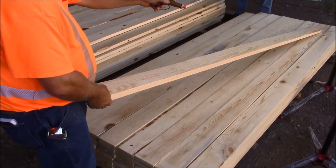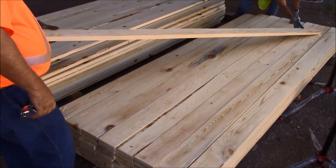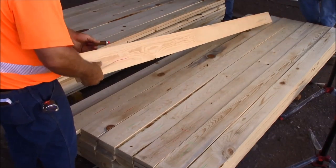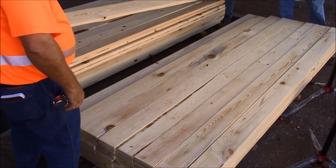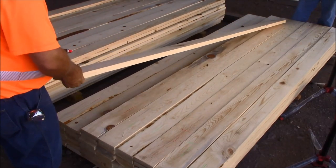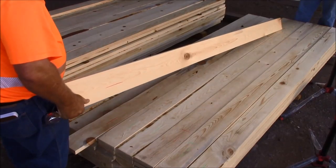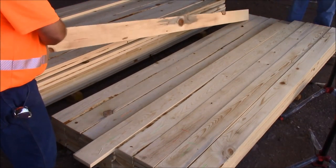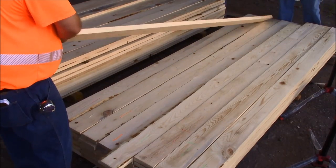Here we have wane down this edge and then down there it's on the other edge. So we take sash cutting on this side, down there we go and take sash on the other side — 3 shop. Here we have about half of the board in stained finger joint material. Here we have enough stain that we have one jam cutting here, but that's not enough to give us a third — it's almost but not quite, and we don't have anything to go with it. So finger joint 3 shop. Another piece of finger joint 3 shop.